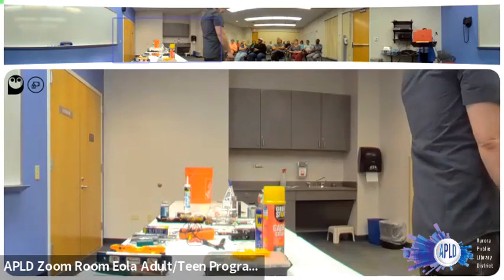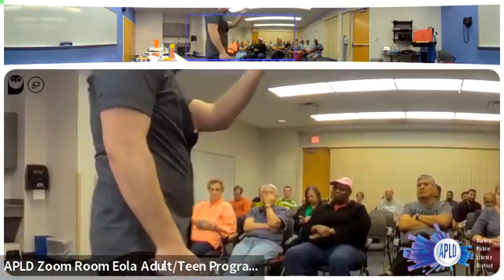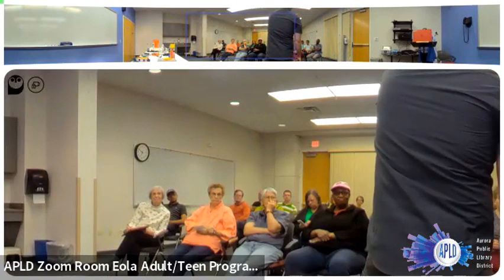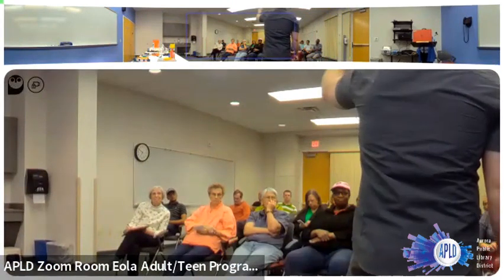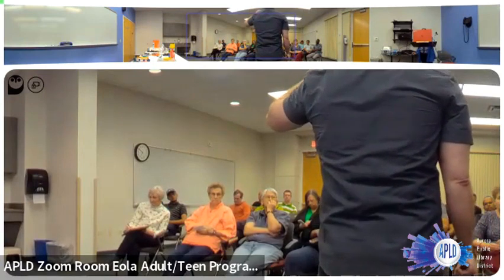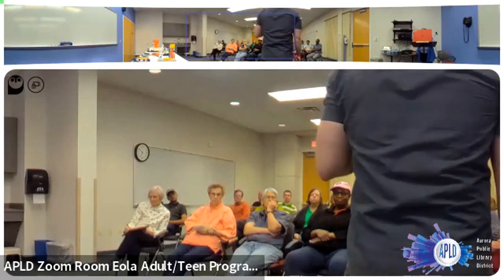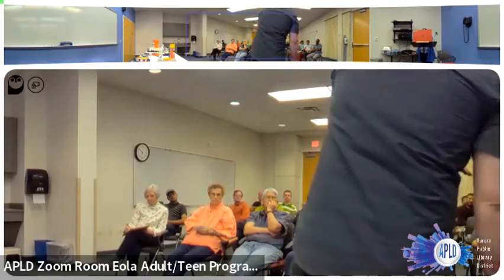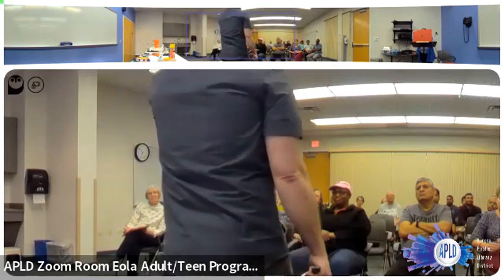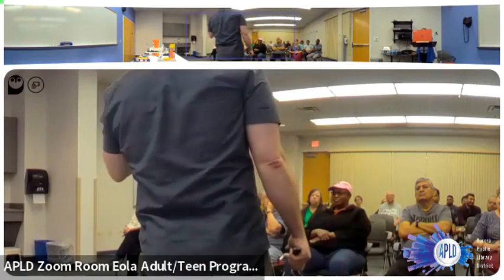Is it dry? I'm just trying to cover up a crack so I can paint over it, like a door jamb on the inside of my house. Maybe I want to seal a little air, but it's not going to see any moisture. Latex. Latex is a little easier to work with, dries faster, and doesn't smell bad. Silicone is going to stand up to water over the long term. The only other question is what color do I want. All the other stuff, there are great products, but don't worry your pretty little head about it. Just go silicone, latex, be done.